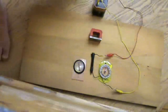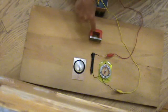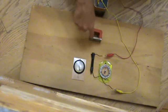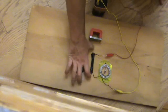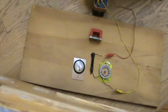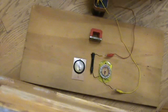This little experiment with the compasses and magnets got me fascinated, so I've set it up more carefully. We have an electromagnet — it's a horseshoe magnet, but very important to have a bar here so that this is now a closed loop spinning magnetic field, theoretically. There are two compasses; this one's got a bubble in it, sorry about that — couldn't find another. If I pulse this with yellow being plus and red being negative, I can make the red compass spin if I time the pulse just right.